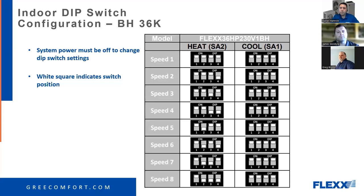Why does the Flex defrost so much faster than a standard 14 SEER heat pump? We have a significantly higher discharge temperature out of this compressor because it runs significantly faster — it's not coupled to just the 60 Hz the power company provides. We can generate significantly more heat, and with the ultra heating part of the system, we can maintain warm refrigerant coming back. It outperforms traditional heat pumps, even inverter-driven traditional heat pumps. A good frosted 14 SEER unit will run every bit of a 10-minute defrost.